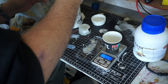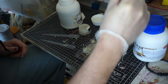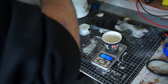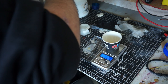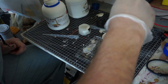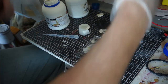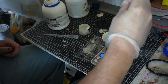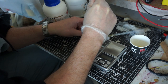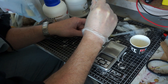After the mold was sort of liberated from the cardboard, I mixed the polyurethane — it's a two-compound, one-to-one on weight and volume. I really love this polyform. The thing though is that with these small batches, you have to be really accurate — you need to use a scale. If you're 30% off, you don't really notice it on these small amounts, but then it will not cure; it will remain gooey, just like a gummy bear. You need to thoroughly stir it and then we will inject it. Usually your first casting is more like a learning experience, especially with this piece. I had to do a second casting to get it right.